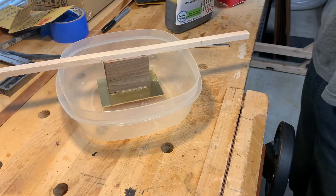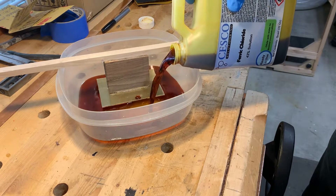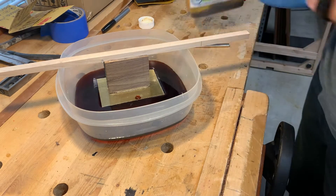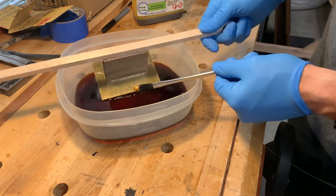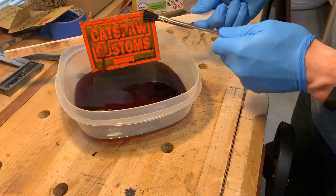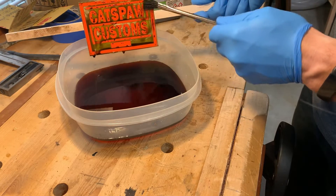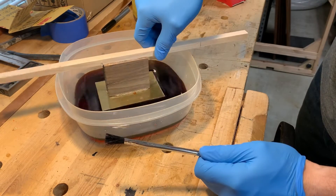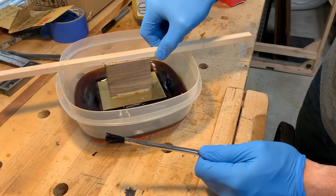You can buy this on Amazon and it is definitely the type of thing you're going to want to wear gloves and eye protection when handling. It's very corrosive and if you get it on your clothes or skin it's the kind of thing you want to neutralize with baking soda and wash off immediately. The amount of acid I'm using here is way more than I actually need but this is the size of the container I had. I like to brush the acid into all the nooks and crannies on the side that I'm etching — any air bubbles here will result in a bad etch. Through experimentation I found that brass this thick with acid at the 43% concentration takes about two hours to get a decent etch. During the etching process I occasionally walk by and agitate the plate.